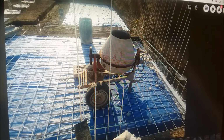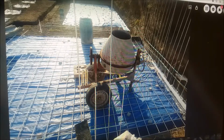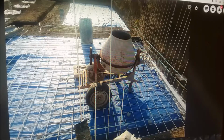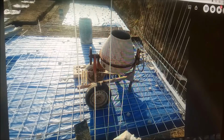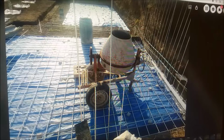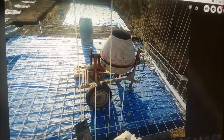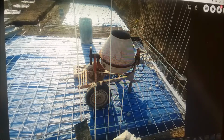So any heat that rises, any warmed air, will go to the ceiling. And then we have an exhaust fan up there with some PVC pipe to take it and blow it outside. But you don't want to have one electronic component on top of the other one, with the hot air going into it. And also you want that natural circulation.